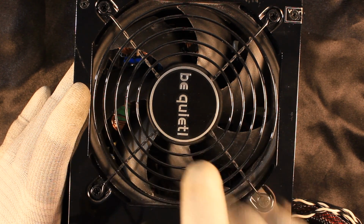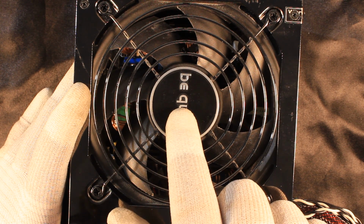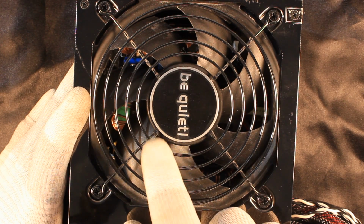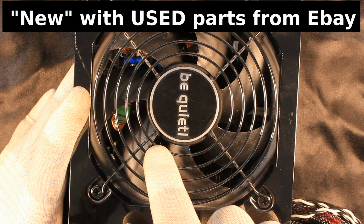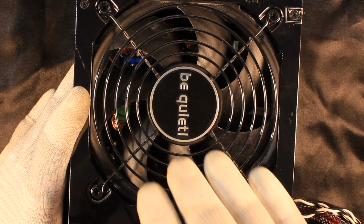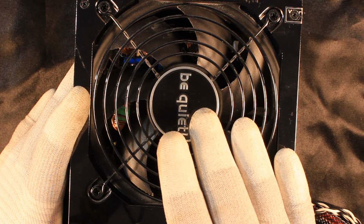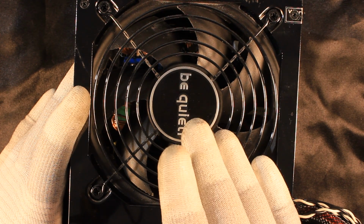good job for me. I bought this power supply about 6 to close to 7 years ago, out of which it was running non-stop 24/7 for about 2 years. You might remember this power supply because I put this into my new virtualization server, and I even mentioned that I should have bought a new power supply. And indeed, now I have issues that if I push the power button, then my virtualization server doesn't boot. It just gets stuck before the BIOS is being initialized.